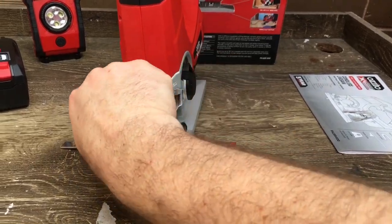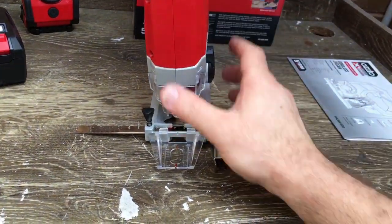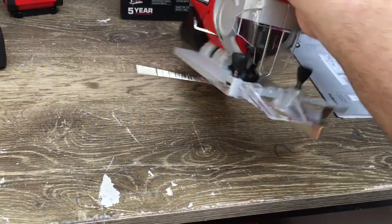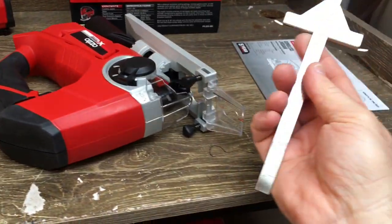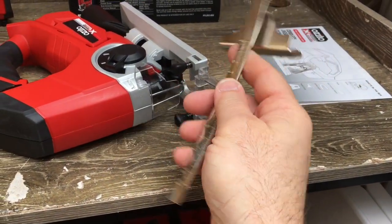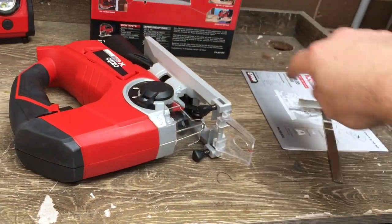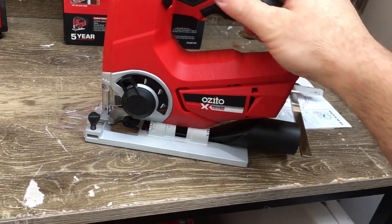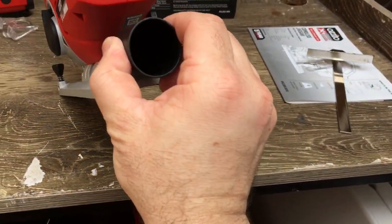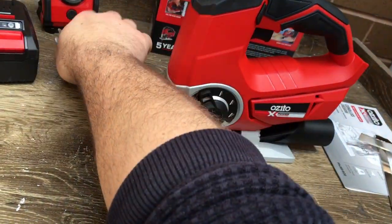It's a really neat tool. It has a D handle on it so it's very comfortable. You get the option of doing a beveled edge up to 45 degrees each way, and they have measurements on that too. The timber guide clamps down with two screws, which I think is handy - that way you know it's in there nice and tight. There's also a vacuum attachment at the back that slides in nice and easily and doesn't really get in your way.